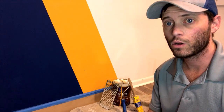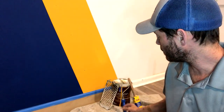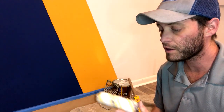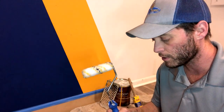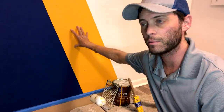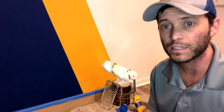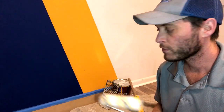There are two different techniques to touching up a wall. You can either touch it up in exactly the same way that you painted it — this here was painted with a roller, actually this exact same roller — and that's really important because the way paint comes off a roller cover is different whether you're using a mohair, a woven, or a striped woven. All of those leave different stipple as the paint comes off. So if you're going to roll it, make sure you're using the exact same roller cover and applying it the exact same way you painted the wall.